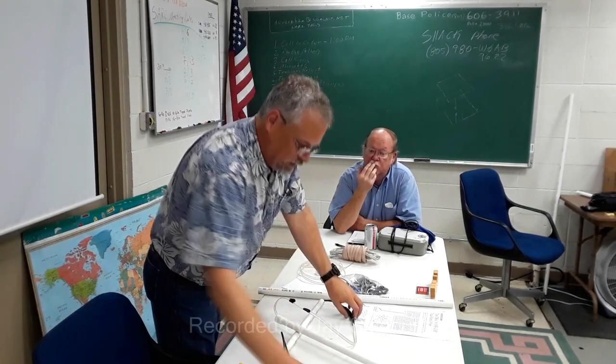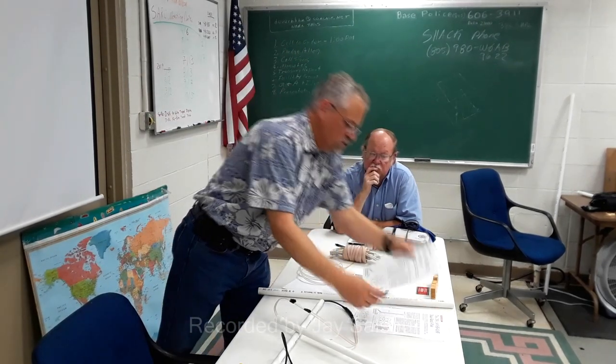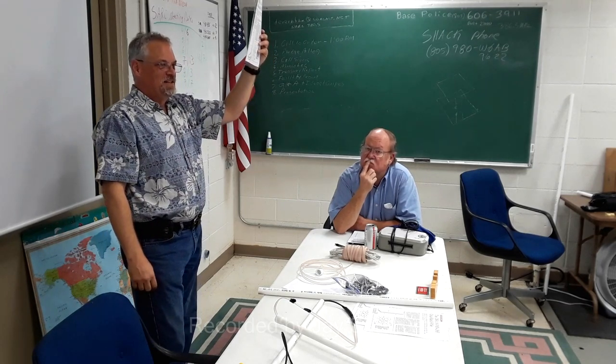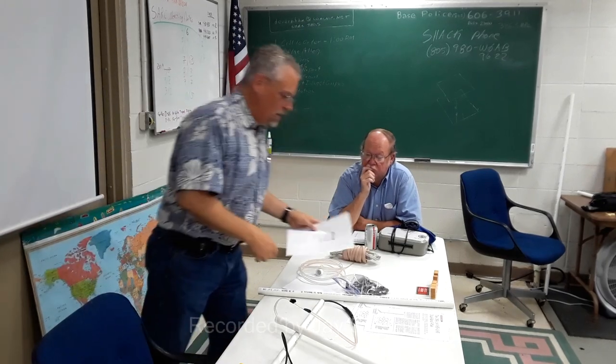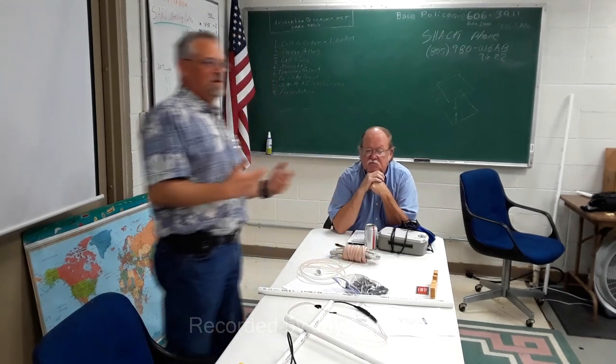Now, if you look at a J-pole, I don't have an easy way to show you this, but is it a balanced antenna? No. Not really, no. Right? It's not like a regular dipole. And so you will have some energy trying to come back. Now, do you really need these beads on a little J-pole like this for low power? No. I do it just because I have them and what the heck, why not?